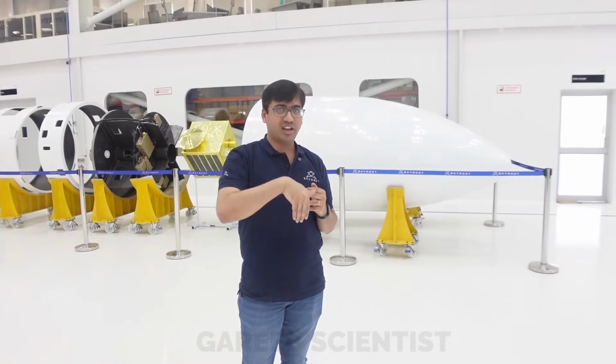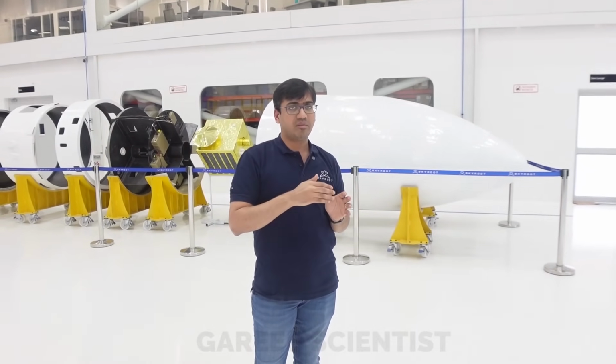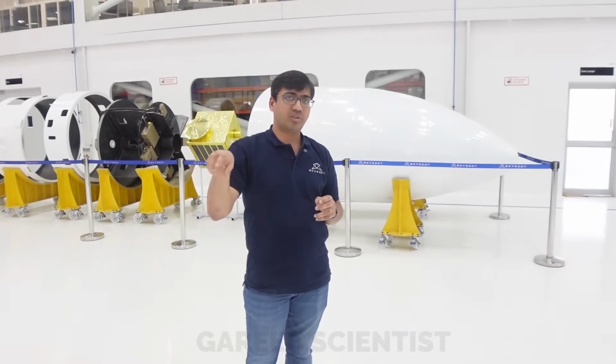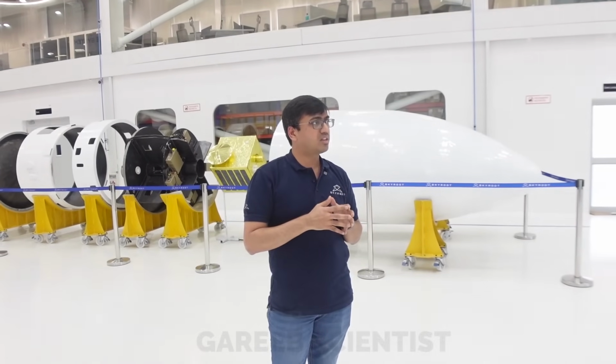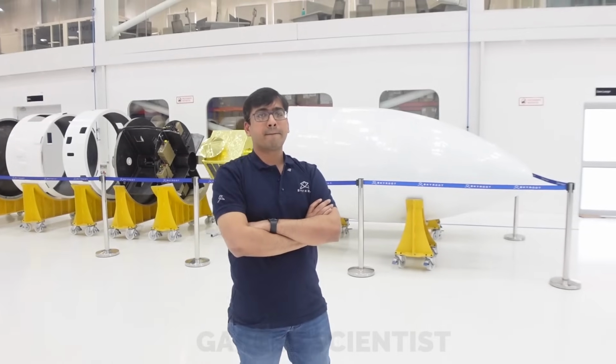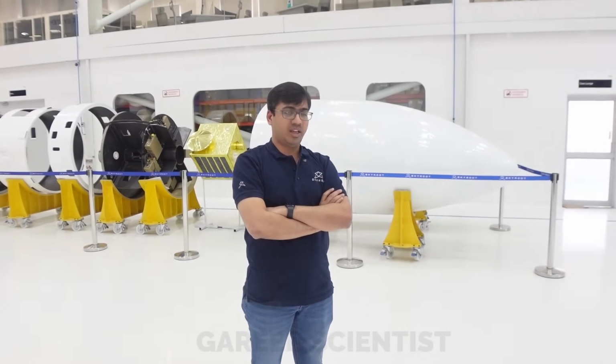Even if locally something opens up, what happens? The clean air which is to be maintained for the satellite escapes out. We have vents for venting slowly, but we don't want dust or air to get inside, because that will pollute the atmosphere inside. We want things moving from inside to outside because naturally there's vacuum outside. We have to vent out to reduce the stresses, so we'll have vent adapters. But we should have all protection so that the dust from the external atmosphere doesn't get in. So you need good seals. As it is going up, it has to slowly release the clean air from inside.